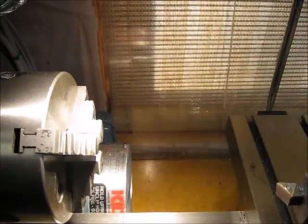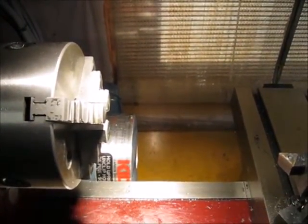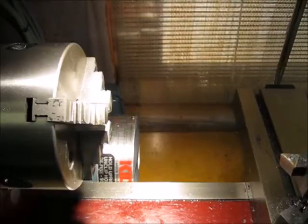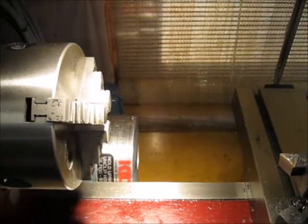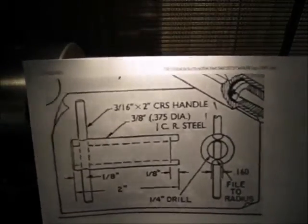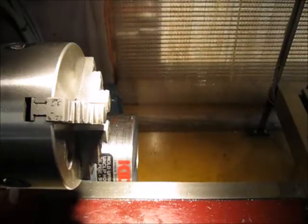Okay, another project — this time it's upside down because I'm trying out my new camera mag mount. My brother requested a firing pin tool for a Lee Enfield rifle. Apparently the firing pin is down some little tube in the bolt and you need a special tool to get it out to clean and adjust it. I went on the internet and found a pretty simple set of plans. I thought, why buy one when I can just build it? So that's the project for today — basically a piece of steel that's drilled out with a handle through it and a couple little tabs formed in it.